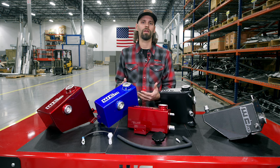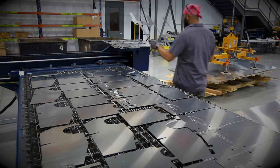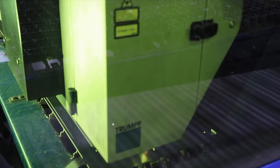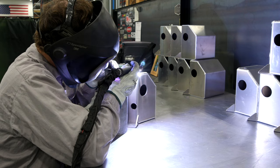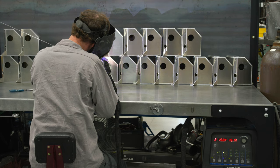In most cases, no modifications of anything in the surrounding area. All of our tanks are manufactured here in-house, starting as a flat sheet of aluminum on our laser. We laser cut the flat sheets, and then they move to our CNC press brake where they get bent. From there, they move into the fabrication shop where they get TIG welded together, adding all of the necessary bungs, fittings, and welding up all of the seams, and adding that WC Fab logo on the top of them.